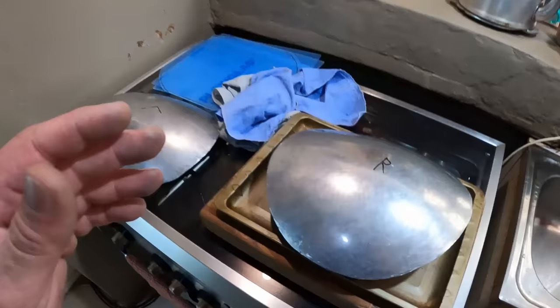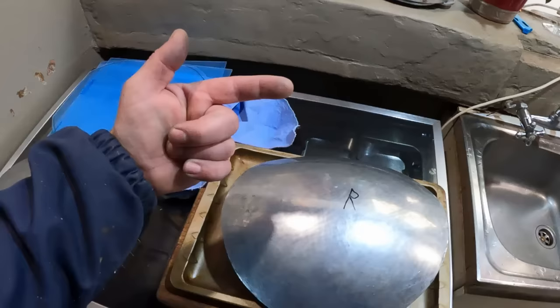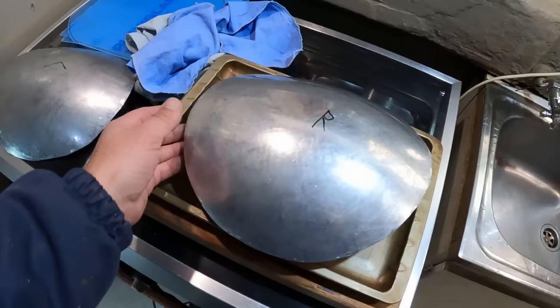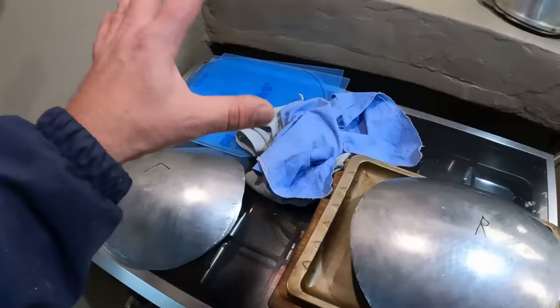Hey guys, welcome to my oven, and today we are baking a set of headlights, and this is how we're going to do it. I've now got my left hand side and my right hand side shapes, the forms that I just made on the Jaguar a minute ago, and guys, I've also gone ahead behind the scenes and made two more forms, a negative of both the left hand side and the right hand side, and that's just going to help to shape the acrylic perfectly into the form that I'm looking for.